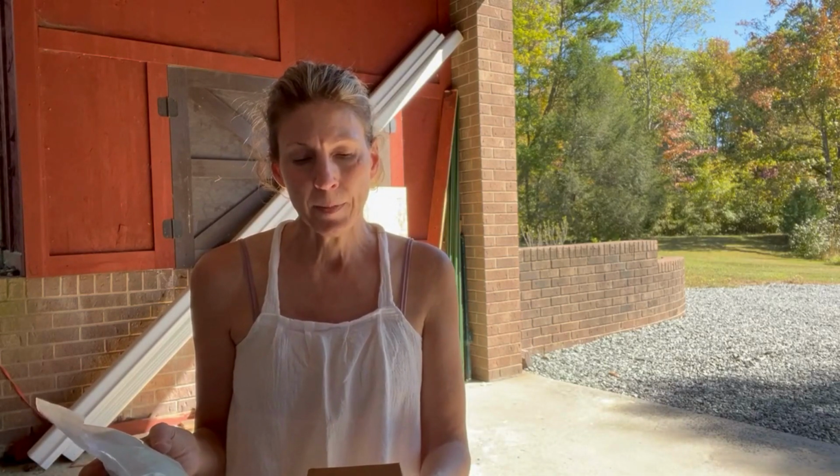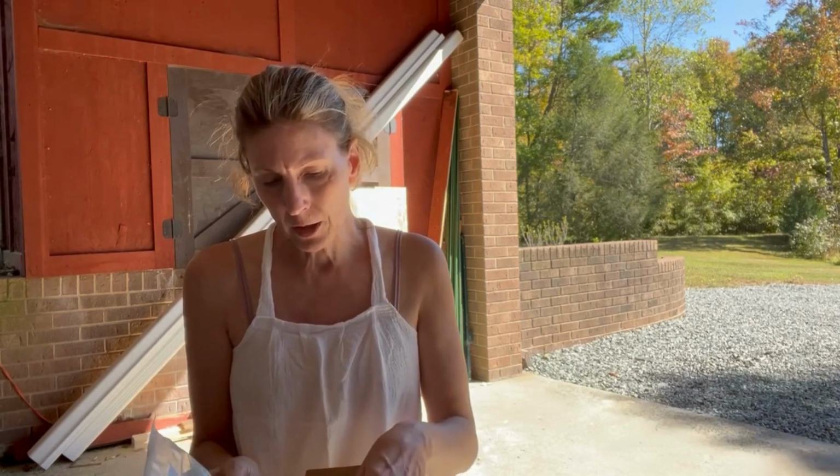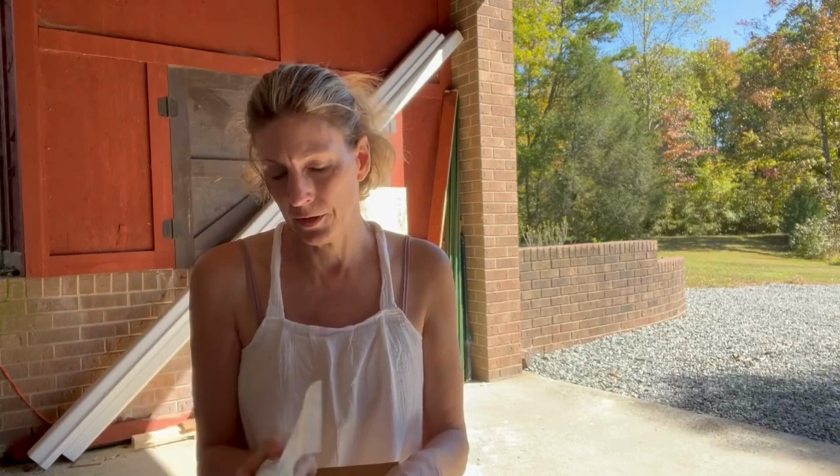It also has 1/2 quart of linseed oil. And I've got like a 5-gallon drum of this stuff. And then a little less than 2 ounces of a clear dish soap. So that linseed oil, along with the pigment, along with the ferrous sulfate, really makes for a superior paint, and it's actually probably cheaper than a gallon of paint, and this will go a lot further.